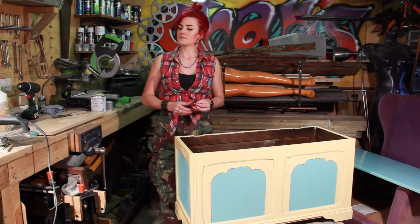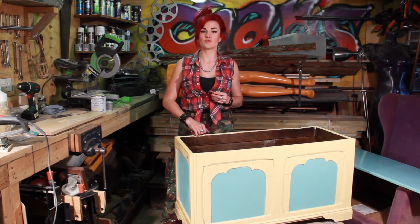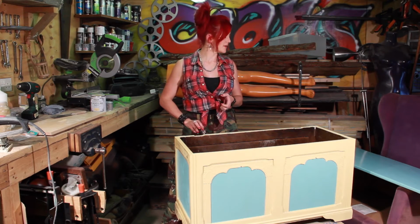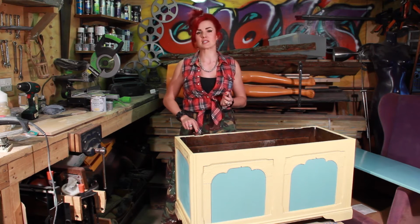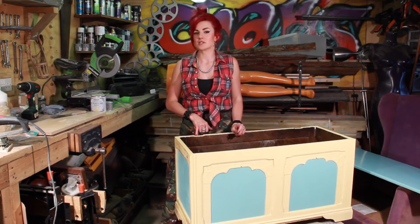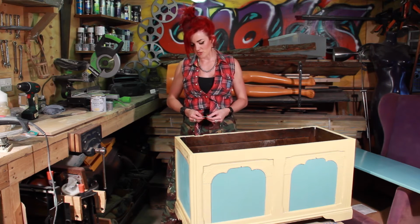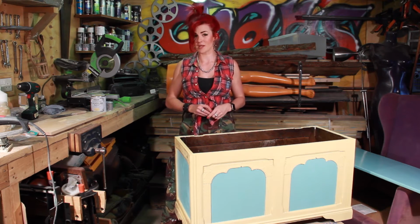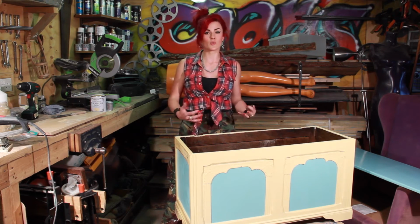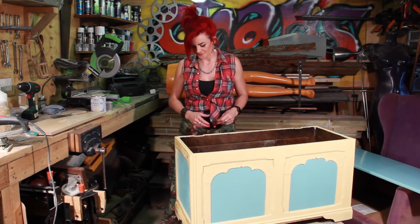So the plan is put on these new ones, but as you find with quite a lot of old furniture, it's already been fiddled with to some degree by someone. Now, whoever put on these hinges has actually made a mistake with the hole that they haven't bothered to fix. So there are 2 holes this side that are very close together. So I know that if I fix these new hinges on, they're probably going to get bent up again in no time, because that hole is going to go straight through to the other one, so it's weakening the whole lid. And in my house it needs as much strength as it can get.